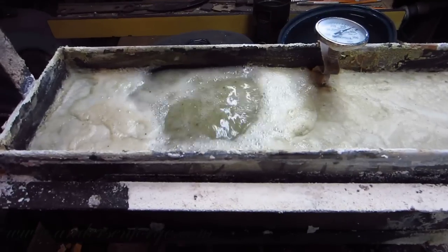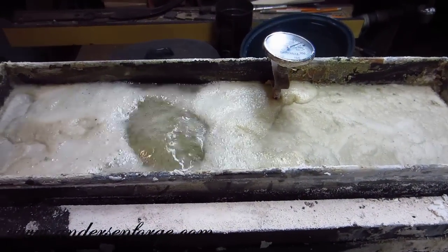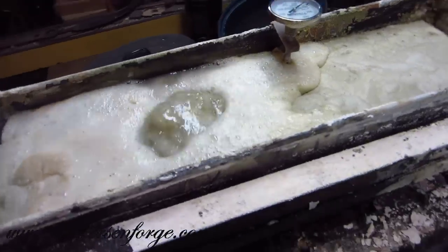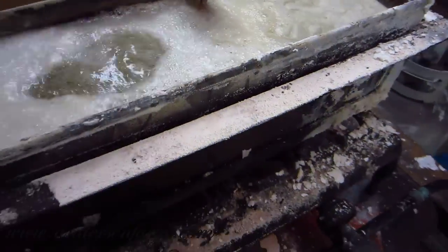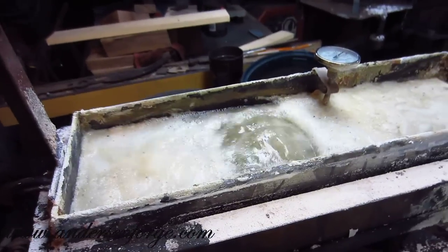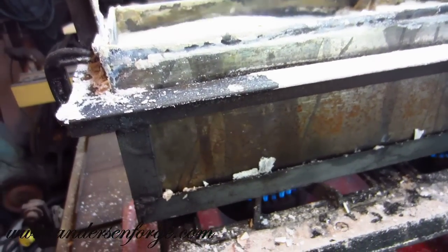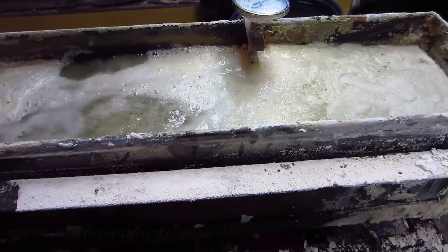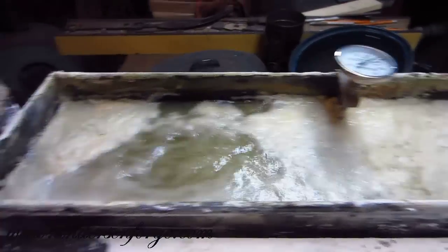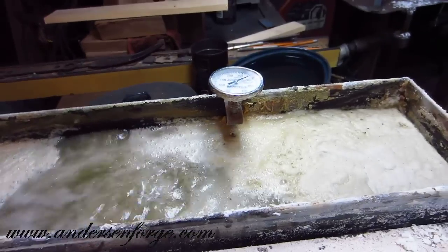We're back. Here's a good little demonstration of what's going on in this bluing tank — you'll see it's starting to boil very vigorously. We're at about 272, 285 degrees. I need to back this down just a little bit. Now, if you remember back in high school chemistry class, when we were discussing the periodic table and atomic weight, there was a term called specific gravity, and that's what we're dealing with here.